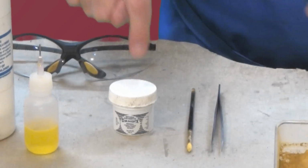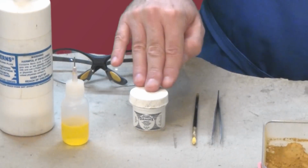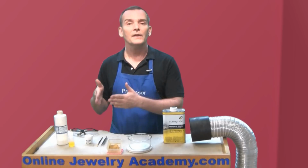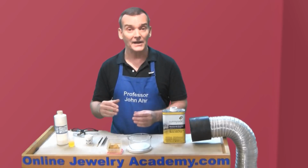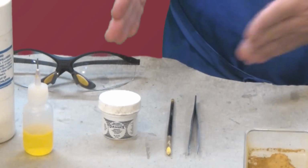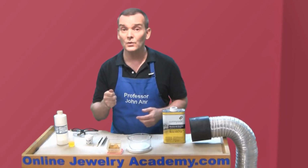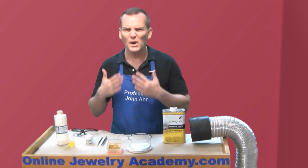Paste flux. This is the one that we're all familiar with. I demonstrate with it all the time. There are a number of brands on the market and they all pretty much work the same. Now, what is this one used for? It's used for silver brazing or silver soldering at a lower temperature, but you could still use it for hard solder. But the temperatures that it works at are much lower. And it will burn away eventually if you stay too long with the torch or your torch is too hot. But it works in most situations.